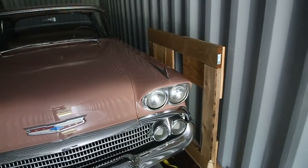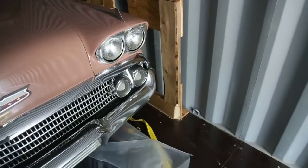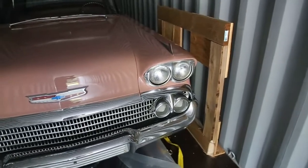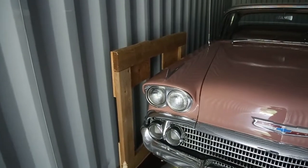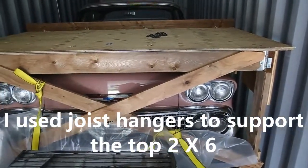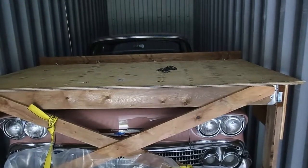We're just getting ready to build this shelf here. I've got the sides screwed down. You can see there that we had to do a little modifying — we had to cut the corner out of the plywood. Put a little 45-degree cut down there to accommodate for our straps. So we'll put the piece of plywood on and see when we get that done. Our shelf is built. Don't forget to put your cross pieces in there — now it will not move. Ready to load up some stuff.